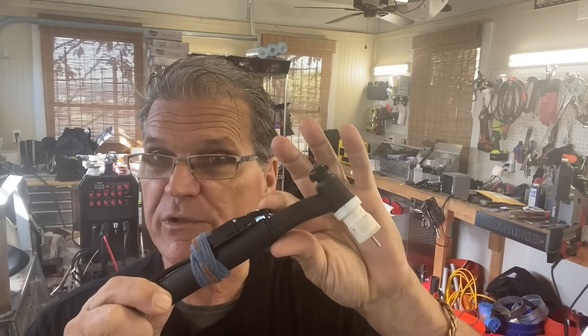I'm going to tack it using a torch switch - these come with a lot of welders. I'm going to be using the PrimeWeld 225. If you've got a torch switch with your welder and you're not sure how to use it, and your welder's got 2T and 4T functions, this video should help you. I'm going to use the 2T function to tack with - no upslope, no downslope, just about 95 amps, put a small tack on there, get off of it. Then I'll do a little bit of welding on outside corner joints using the 4T function. On 11 gauge you don't really need that much amperage control - I can dial it in. I don't really need a foot pedal, but I'll have upslope and downslope for the beginning and the end.